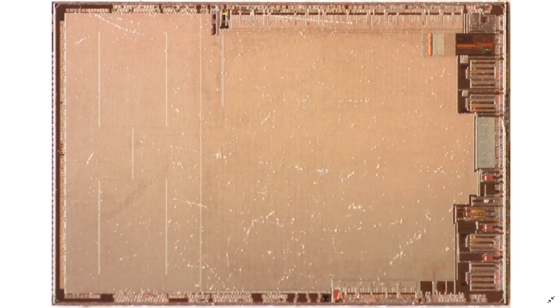Let's first take a look at the SoC. This is what's known as the top metal layer. This very silver-goldish area is the power and ground distribution for the chip. Under here is actually all the very interesting logic for the controller. On the edges is what's known as the IO ring. On the left-hand side here we see some sort of more sophisticated IO, and on other parts of the chip we see less sophisticated IO.